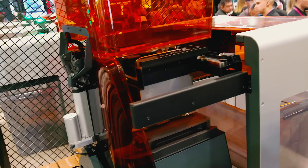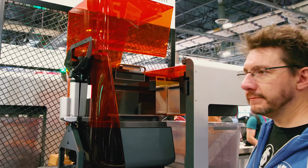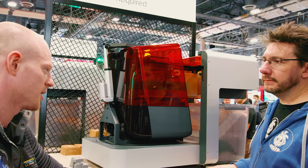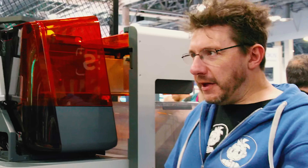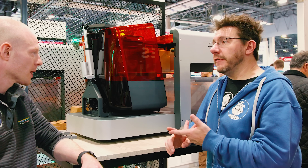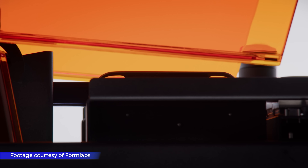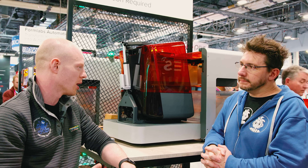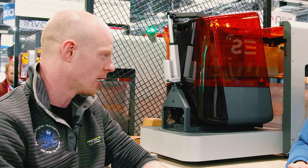The system attempts removal up to five times per cycle. The vast majority of parts remove on the first pass. During removal, the build platform presses down slightly on the back of the tool head to ensure it's actually scraping the surface. A force sensor identifies whether parts have been effectively removed. If not, it goes back and tries again. At a certain point if removal fails, it will stop and alert the user to come help. The scraping action also clears small debris from the build platform.